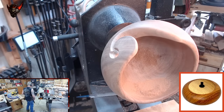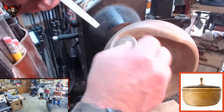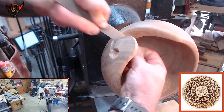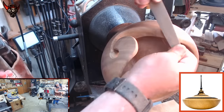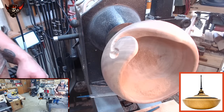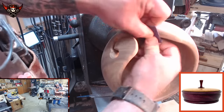Alaska Woodturner says I've been using Mahoney's oil. It makes a nice finish with a little wax buffed in. Hey, you know what? Sarah says, look at Hula throwing down some sick grass. That's what I'm talking about. Alaska, all my food grade finishes are 100% Mahoney's. When I go to my yarn bowls, I want something a little more durable that holds a little longer. Mahoney's is just a food grade finish. To me, it doesn't hold on. It needs to be redone regularly, you know? And I don't see that issue with Danish oil. So on my yarn bowls, I always go with a Danish oil. I've seen some of those guys do polyurethane, but you can see streaks in it. And I'm like, oh God, no, man. Don't do it. I mean, to each their own, I guess. But for yarn bowls, 100% Danish oil. For food grade bowls and stuff like that, Mahoney's all the way. I love Mahoney's.